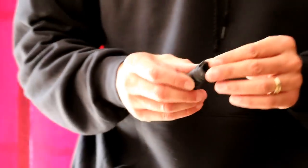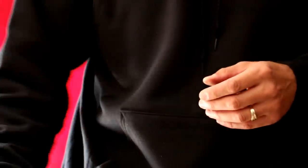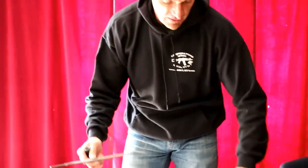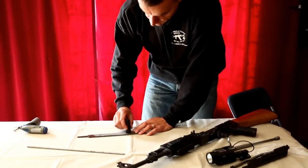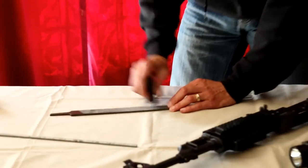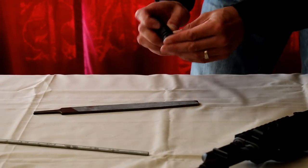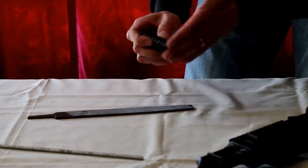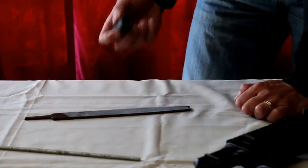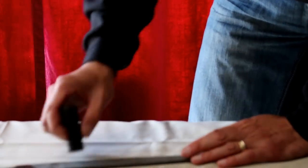Going back to the original problem: what to do with the muzzle brake to make it sit tighter on the end of the barrel. Basically, you take the file, put it on a flat surface, and start moving the brake like this. It may take a while until you get that surface filed off a little bit, but what you want to do is create that room, that space. In our case we need half a turn — we need to do this to have the ability to tighten that brake up to the barrel.